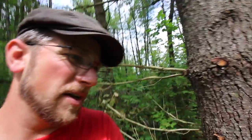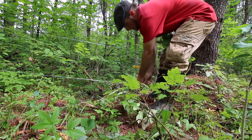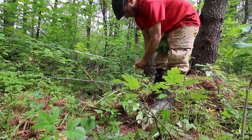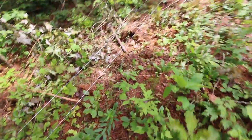So after you get your fence all up and you've gone around and you pulled out all the weeds and you've inspected the height of the fence, you want to go around and look for the contour areas of the land where the fence doesn't meet the ground. Because the way the ground goes, I'll show you right here. It gets pretty high right here, so if we can put another fence post here, then we can set the fence at the height we need it. So then look, we look down the fence here, it does it again over here. Right here.